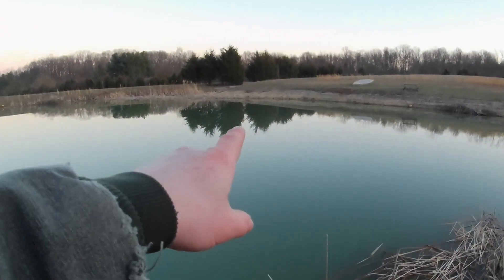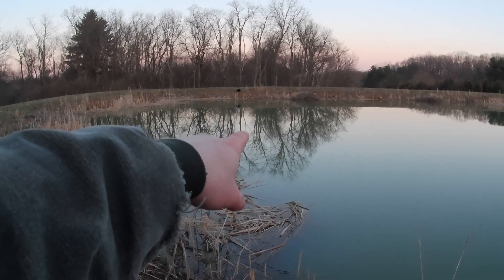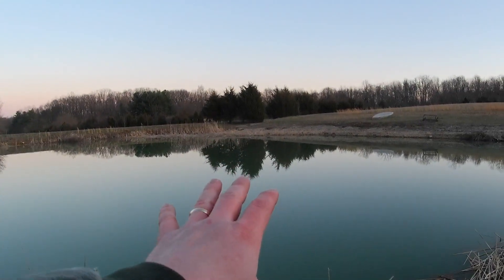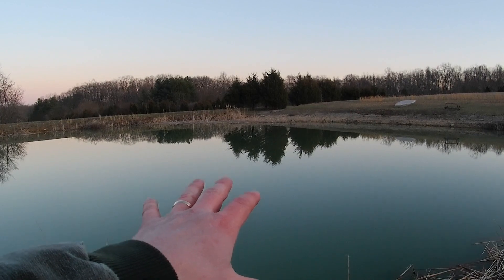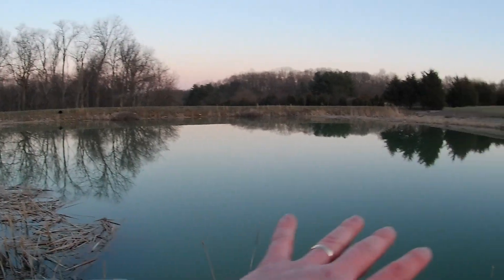In the spring I'll place the diffusers again — one out here at about eight feet deep and the other at the very deepest point at about ten feet deep. With those ball valves I'm able to adjust the flow to get equal air distribution to each diffuser. The shallower one has less pressure so the air tends to want to come out that one more, but by adjusting the ball valves I can get equal pressure and equal air distribution to both diffusers.